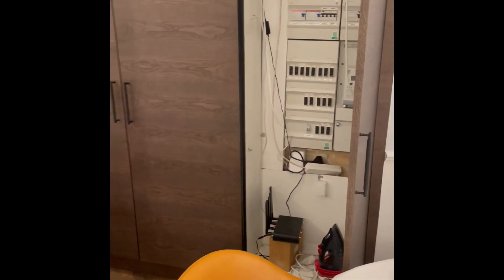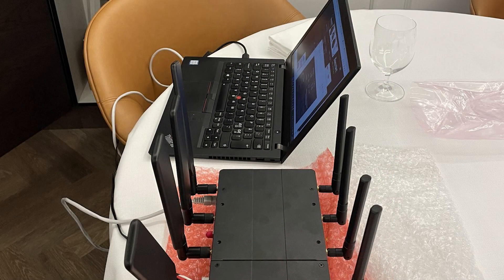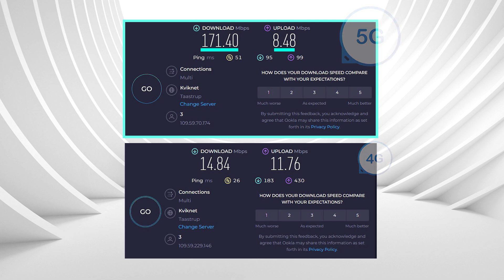I disconnected the Huawei router and moved the SIM card into the Billion 5G router. To start with, we'll try to see what speed we can get with the OEM paddle antennas. This is the speed we get with the Billion router mounted with the paddle antennas. Switching from 4G to 5G made the download speed more than 10 times faster. However, the upload speed actually got worse, most likely because of the bad isolation between the four paddle antennas.